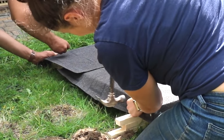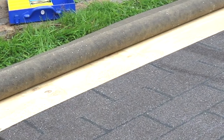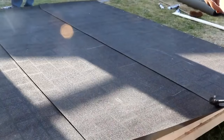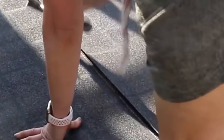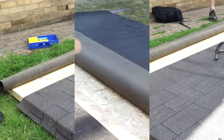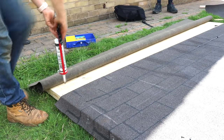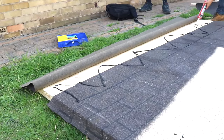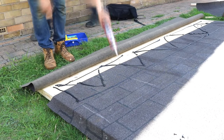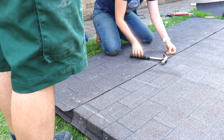For the opposite side of the roof — the tallest part — this was also clout-nailed, but just on the longest side to allow me to overlap it. I flash back to my method where I mark on the other sheet with a hammer to create an indicator for where the overlap falls. That way I could pull it back, make some more marks with a hammer indicating where the spars are — this is where my clout nails will go after I've applied the bitumen. Then I put the sheet back, pressed down evenly with my feet, and clout-nailed it down where those spar references were.